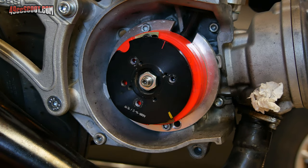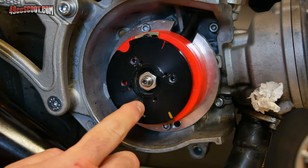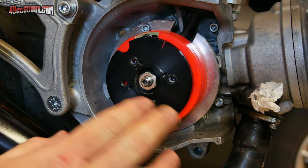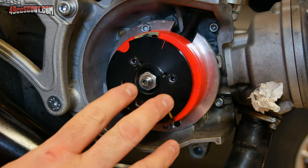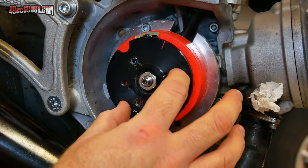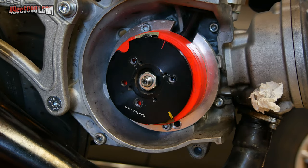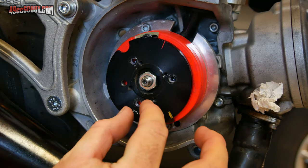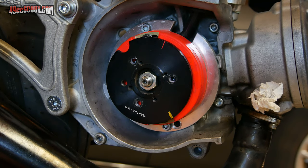And it's very important that this stays true, because you're talking about something that's going to spin at 14,000 RPM. You don't want it to be wobbly and out of balance. So that's a big chunk of metal, a 2.5-inch diameter rod, especially to work with the mini lathe. I'm not saying it can't be done, but then when you start taking that down to 5/16, you're also removing a lot of material. So I'm not sure that that's going to be the greatest idea for me.